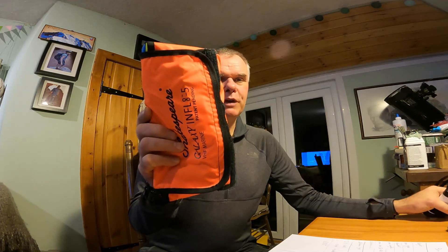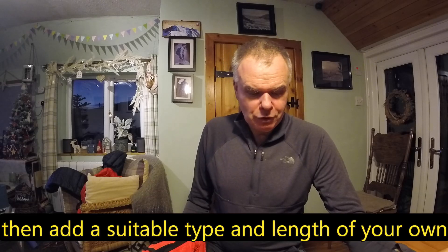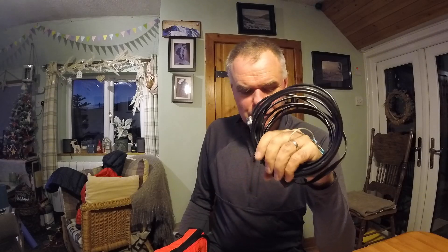There's a massive difference using really skinny coax at VHF. The Slim G can be ordered with a PL-259 or a BNC — I've got one of each. The inflatable comes with a PL-259, which isn't the best at two meters and is really pretty poor on 70 centimetres. The Slim G comes with four meters of coax which I've always found is plenty; the inflatable comes with six to six and a half meters — probably more than you need, and considering it's quite lossy, definitely more than you need.